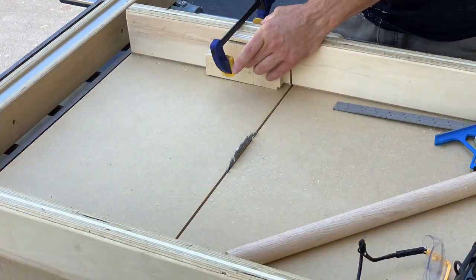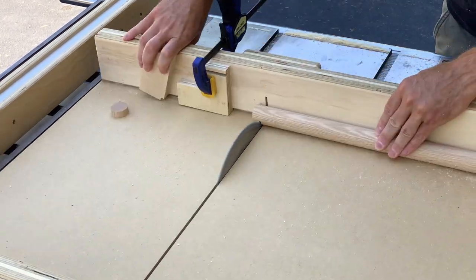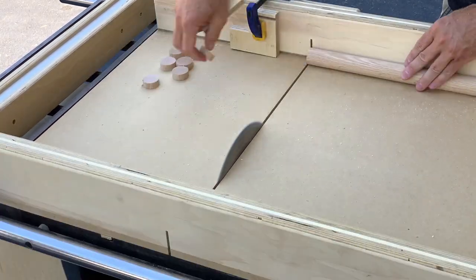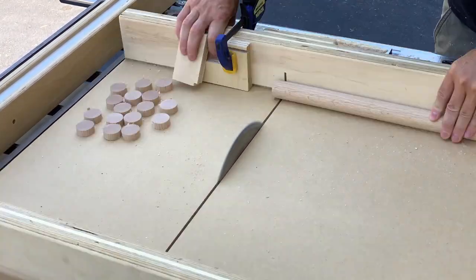For the pucks, I bought a piece of 1.5 inch oak dowel. I pulled out the crosscut sled again and set up a stop block to cut 1/2 inch sections. I made sure to use a removable block to help size the cut, then took it away for the actual cut to keep that cutoff section from getting pinched between the blade and the stop block and turning into a slap shot.